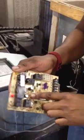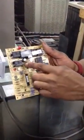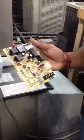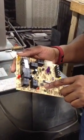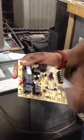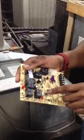Back to your circuit board — you have a little terminal right here in the middle by itself; that's going to be for your flame sensor. It says FS on that little terminal. This is the dip switch setting so you can adjust your blower motor on time and delay whenever it comes on during the call for heat — that's what that's for.